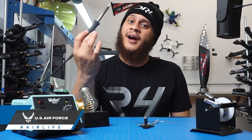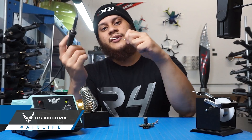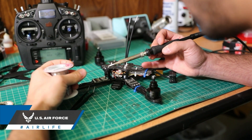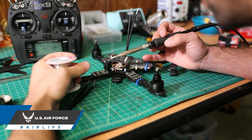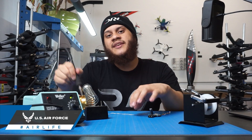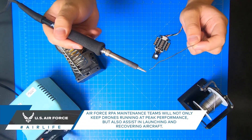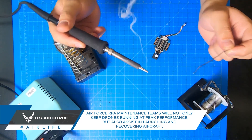The first thing you want to do when soldering is grab your soldering iron or soldering pencil. Pull off a bit of solder — it's really soft so you should just be able to pull it right off with your hands. The first step is to tin the tip, which involves touching the tip of the solder to the tip of the iron. Then put it in the brass wool — this allows the solder to spread evenly around the tip of the soldering iron surface. Touch it one more time just to have a nice point of contact.